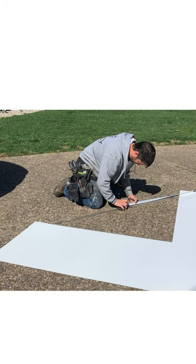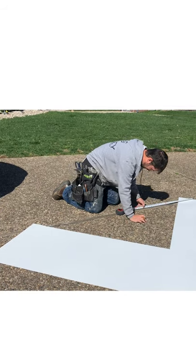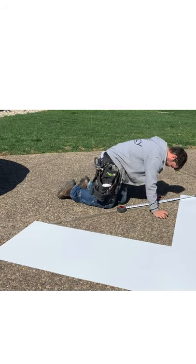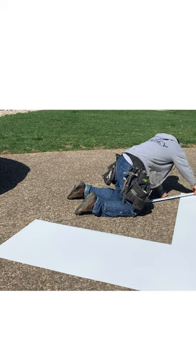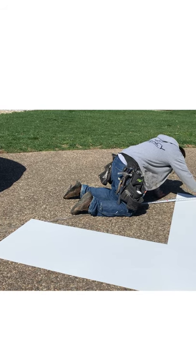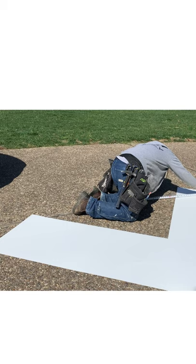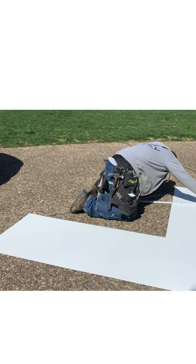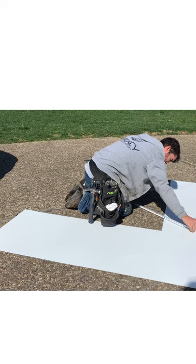It was like 38-3/4 or something. So I made sure my center of the triangle was down low enough so I can cover this whole arch. You want at least 5 inches of metal towards you of this arch you're tracing out. So when you trace this line out, you want at least 5 inches of metal on your side of this line.